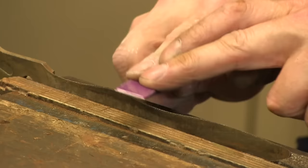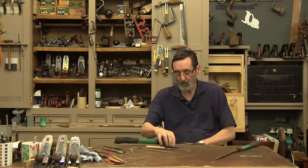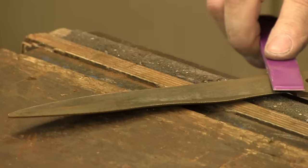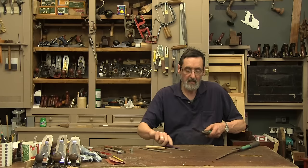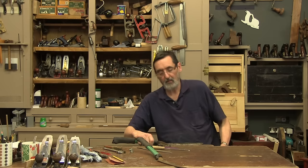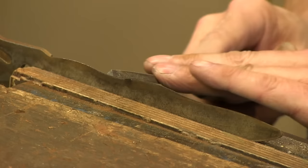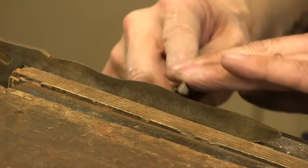Now I could go with this finer piece of equipment — a diamond file. If you don't have one, don't worry, just go straight from your file because these are going to cut beautifully when we're done. Back onto this file just to take off the burr from this side — you don't even need to do that; when you put the shears together they're going to break off anyway. That's just a burr left from unsupported steel. Here again on this side, angling and following the bevel, going right into the crest into the hollow. If these were flat you'd just do a draw file along the length.